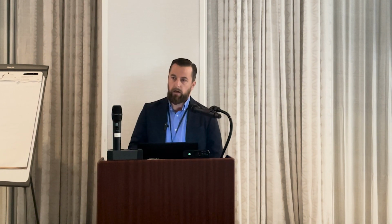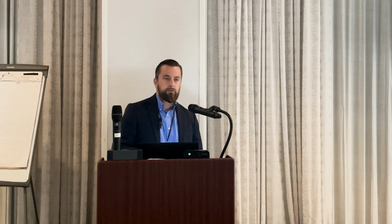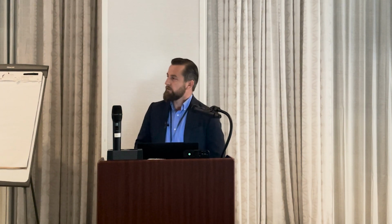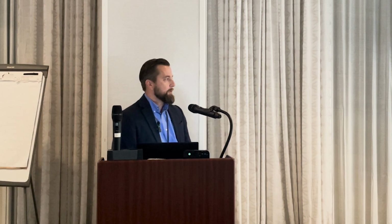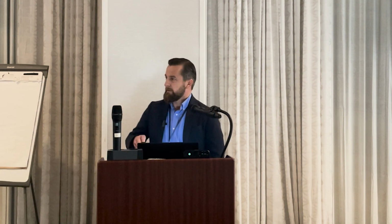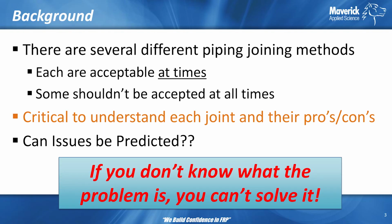Can issues be predicted? We get this question a lot. We get pretty frequently, hey, what do you think about UT, or what are some non-destructive methods that I can use in my miles of pipe on my plant site to predict the issues at every single joint? They're useful tools, but the tools are only as good as the availability that you can use them on. If you have 1,000 joints in your system, are you doing UT non-destructive on every single joint? There's a lot more to that.